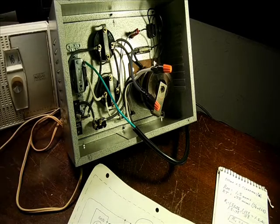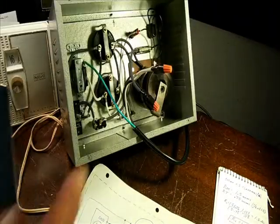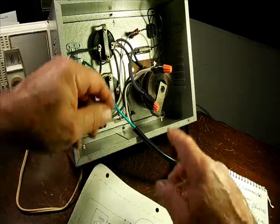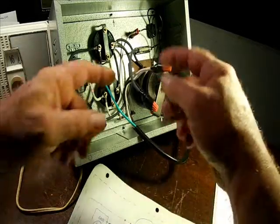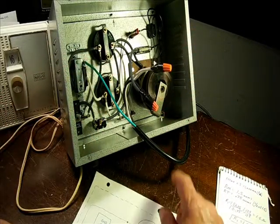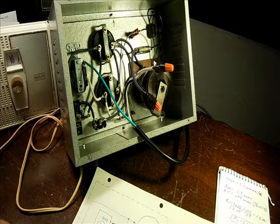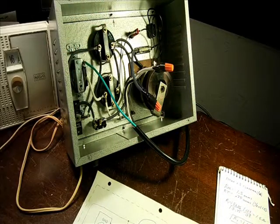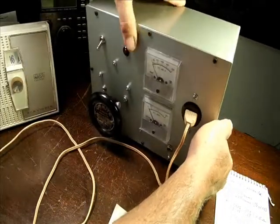So, I'm going to finish tying this off with the back plate. Got a nice grommet for the cord, but before I secure the back plate, I'm going to take these back apart and tie an underwriter's knot in the main power cord. So if the cord gets tugged on, it's going to tug on a knot and not on any of the connections. So actually, we can give this a little test.